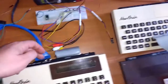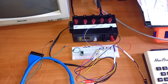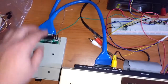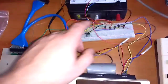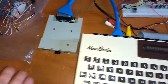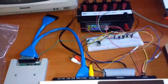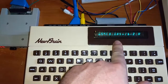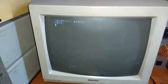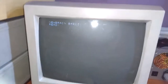I will need some extra wires to power the disc controller, so I will get that done now. It's all connected up with these breadboard cables — the GoTek to the disc controller. I already tried if I can get it to work but I still get the same error message, so it's not working yet. I put the 6.5V on, then you get this noise on screen that takes about 6 to 8 seconds, and then the computer will boot. Then we get Newbrain Basic. The GoTek is also powered on, and if I now type the CPM command to load CPM, the GoTek will light up.